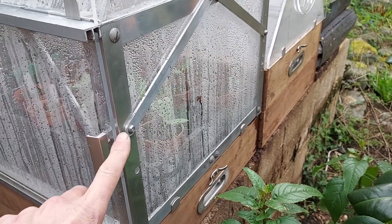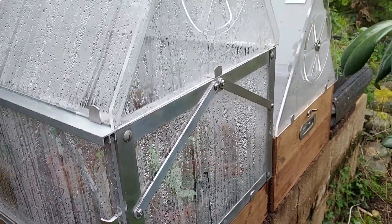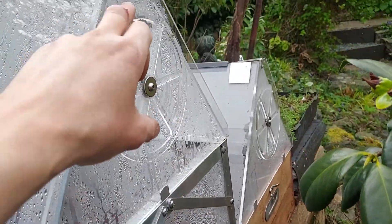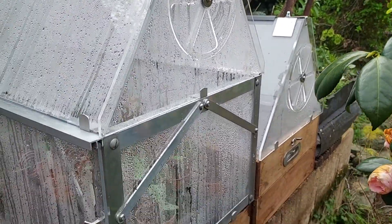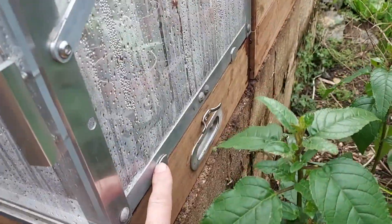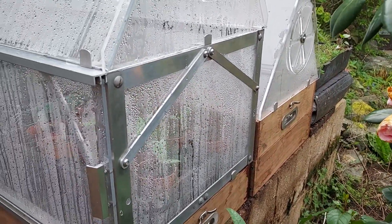I radiused the poles in there - I cut the ends off, the holes were quite large with a large tolerance. I've got the vent on the end and I'm going to put another vent down here as well. I'm thinking of putting an 80mm exhaust fan on top too. I made templates and pattern-routed these pieces out - it's got these little clips so originally the top section was sitting down on here like the one behind it, and then I've made this as an extension.